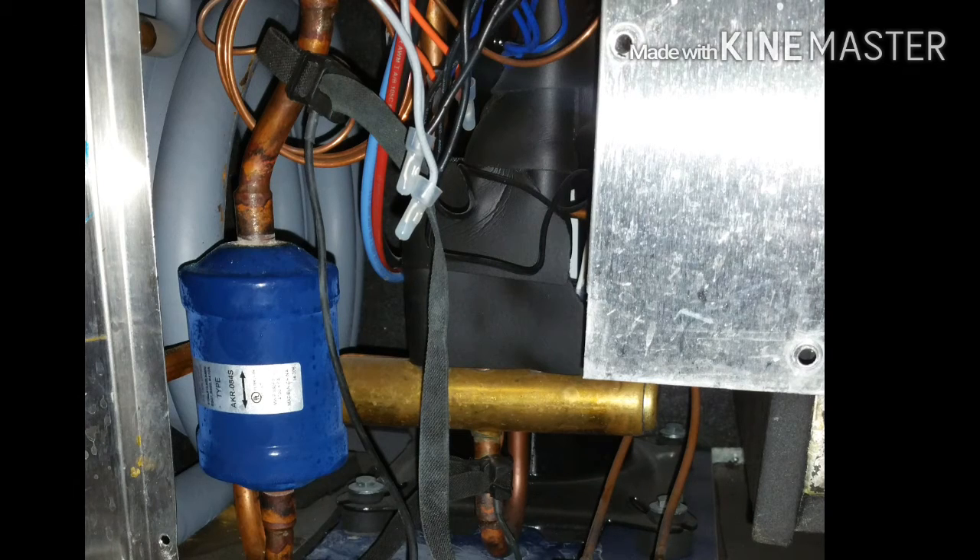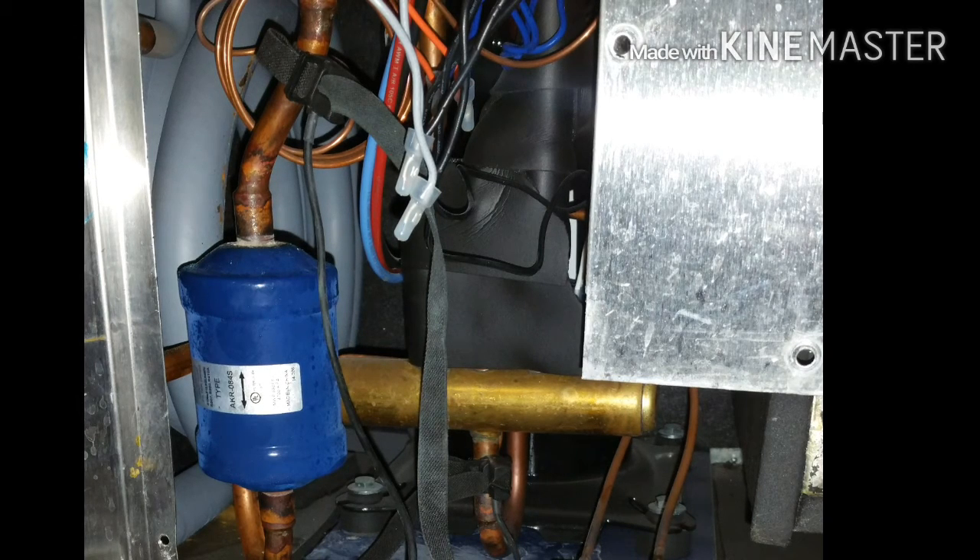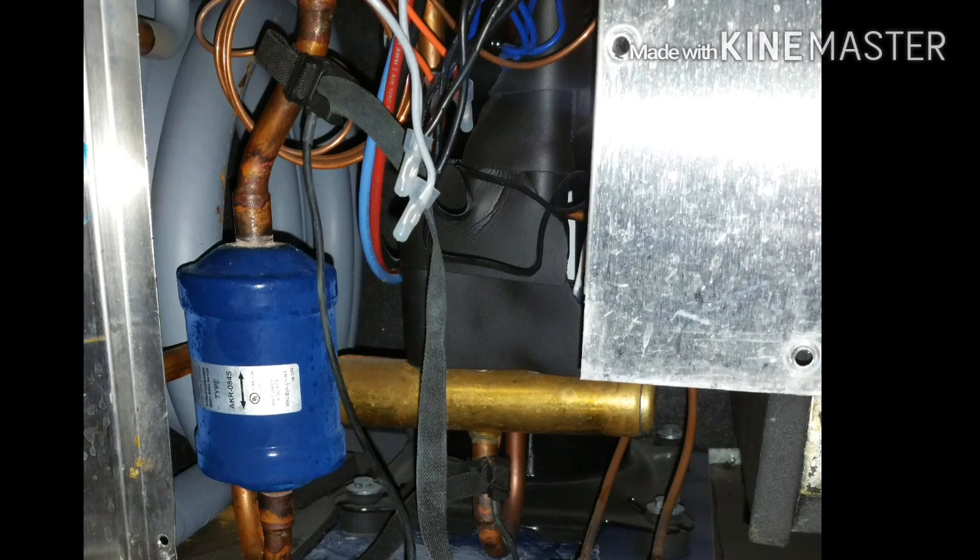All in all, the pressures seem to be fine. The pressure switches are artificially high from the factory, and this manufacturer should send out brand new pressure switches. The question is who will pay for all the labor to evacuate and recharge the units.